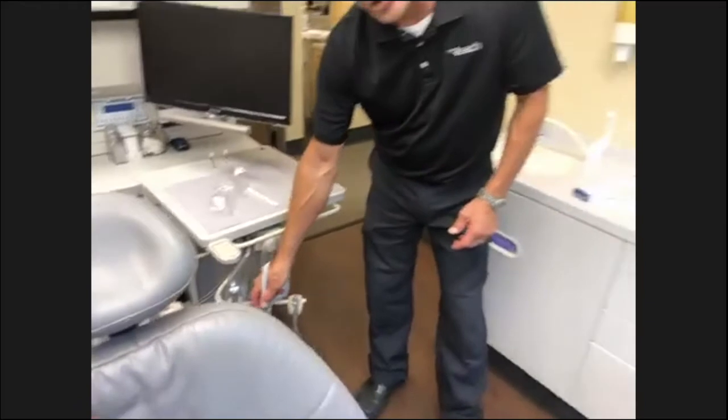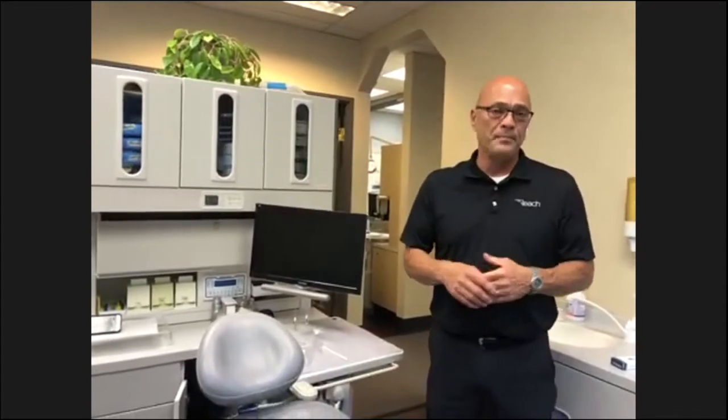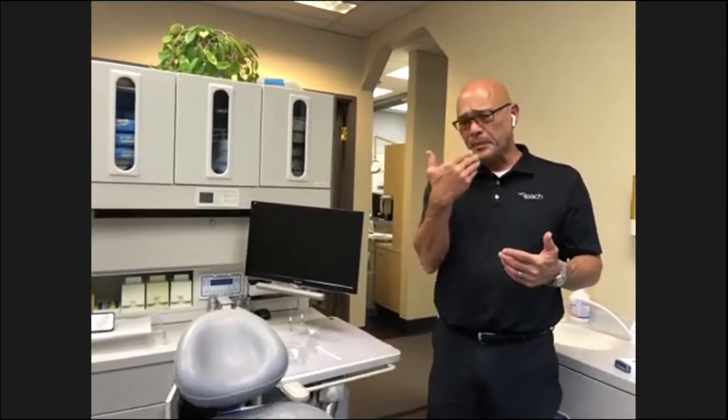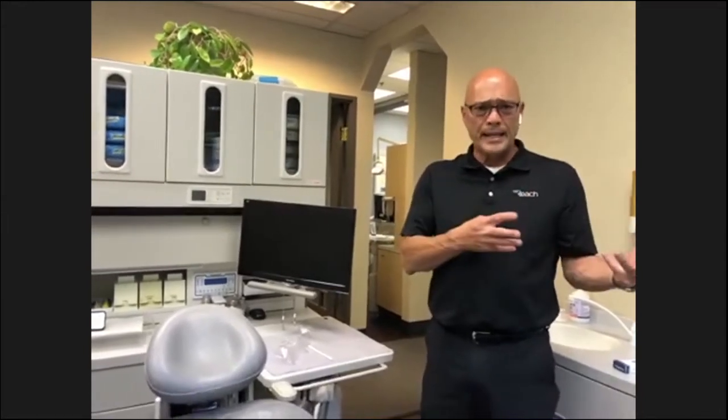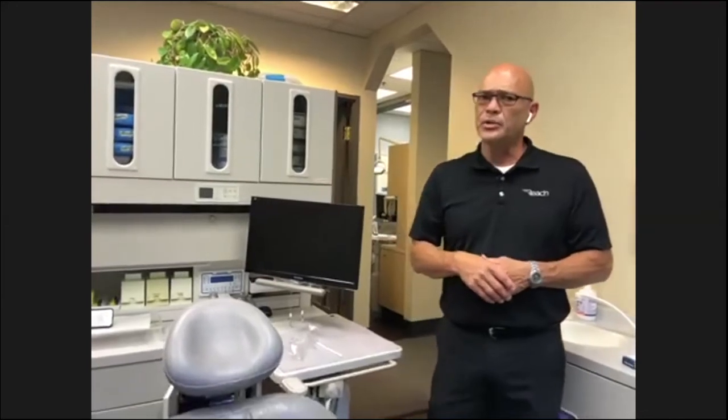So you need to make sure that your pump capacity is there to handle those extra suction devices that you're adding on, whether it be the in-mouth, the Leaf or the IsoDry, those different brands. They help with the aerosols, they help with the retraction, but the suction is there. You're adding more strain on your vacuum pump. So you always want to make sure you talk to your service technician to make sure your pumps are adequate